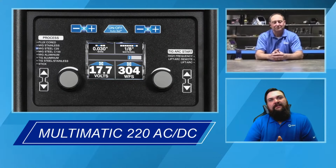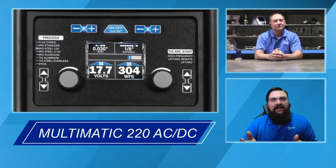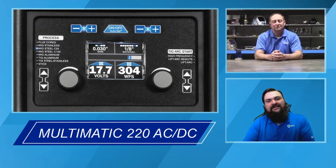Right, and that's one of the things I really like about the AutoSet Elite. If you look at those trapezoid shapes on there, anywhere within that range is going to be a weldable condition, especially for those who aren't welding every day. You type in, like Chris said, a couple of different variables, the wire you're using and the size material you're welding on, and you can go on the low end of one of those knobs and the high end of the other. It's still going to be a good, solid, weldable condition where you don't have to spend a half hour on a project trying to understand what's going on in your process, or whether you're making a decent weld. So it makes it very intuitive to set up.